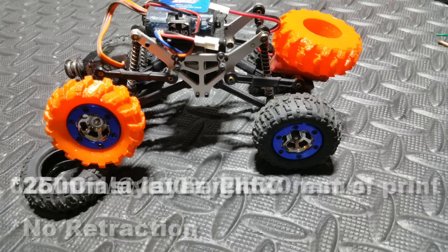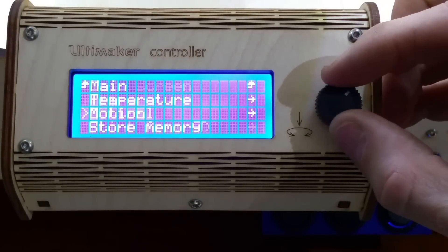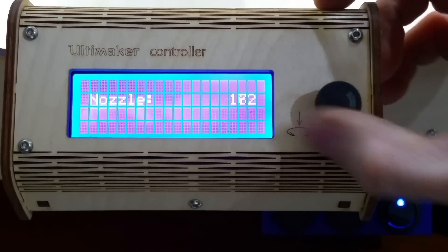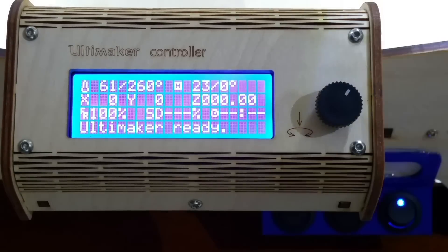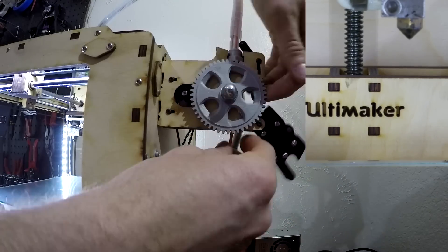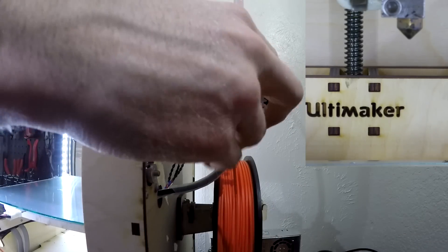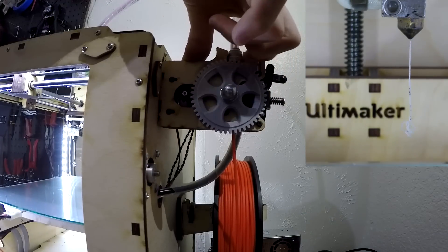You can print on a glass plate without a heated bed. To purge all the old plastic out of your hot end, set your temperature to 260°C but don't let it sit for very long — filaments will melt and turn into glue if they're not passed through the nozzle. Cut an angled tip into the NinjaFlex and feed it into the Bowden, keeping good pressure from the filament into the hot end and keep advancing the extruder.